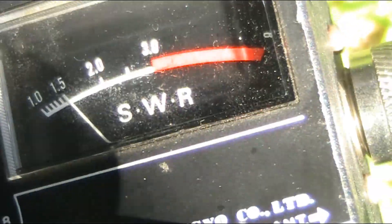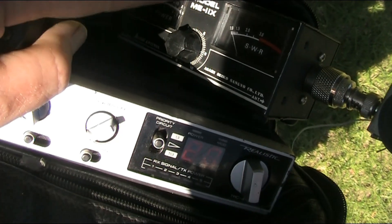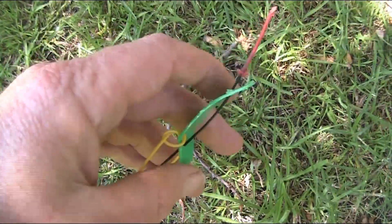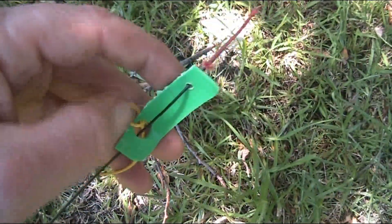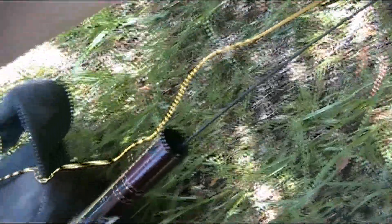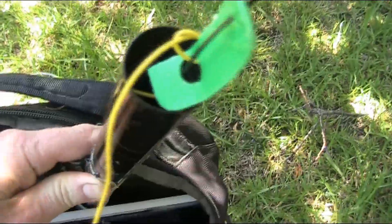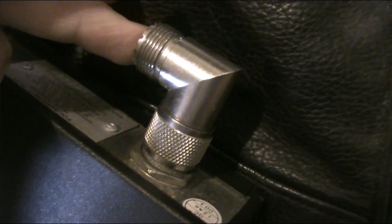The variation you see is because the wind is blowing the wire around. All this means is that I can go pedestrian mobile — I don't really need to take the VSWR meter with me. I can just set it to very close to fully clockwise and be reasonably confident the VSWR will be fine. At the top I've just got a piece of flexible plastic with the top end of the wire tied to it. Inside the backpack I have a chopping board and pipe that holds the fishing pole — it's about a 5.4 to 5.5 meter fishing pole, which forms the antenna mast.